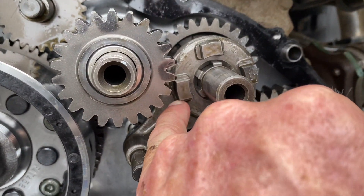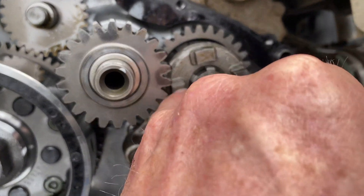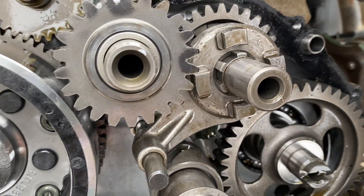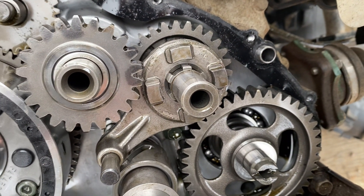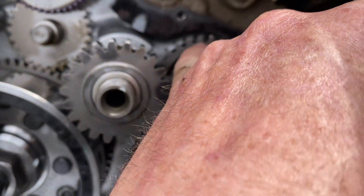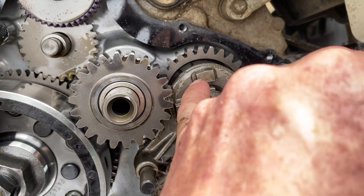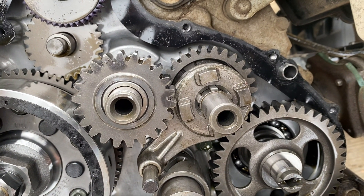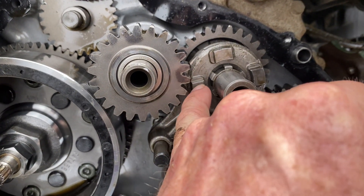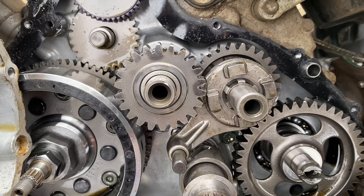You can see it's got these teeth on it, and it has teeth that are a different size on the other side. This is the actual gear that drives everything — you can see it's got splines on that shaft. This is the only gear that has splines in this. This is the center gear; the bottom one free spins and the top one free spins. The only time it's engaged is when this moves up or down and locks it into place. So essentially this spins driving this, and then this drives either the bottom gear or the top gear depending on what position you're in.